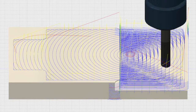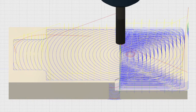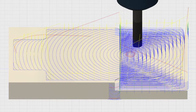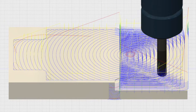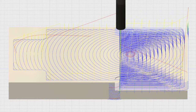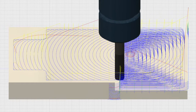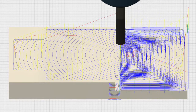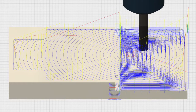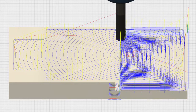In Fusion 360, one of my favorite things is the CAM simulator, which shows you a one-to-one exactly what the machine's going to do. One of the neat things I have added on top of that is since the machine was basically designed and built inside of Fusion, including the bed, I can include that as a fixture within Fusion 360. So it knows where the bed's located, it knows where the clamps are, et cetera. So it can do collision avoidance.